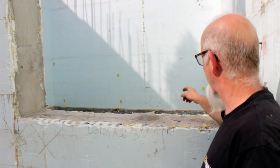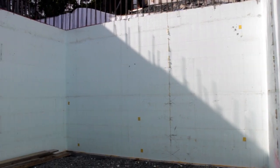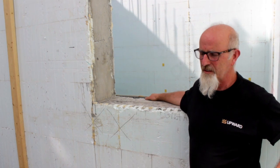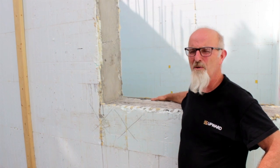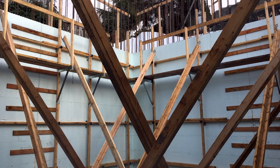We didn't have to worry about getting specialty ties for different widths and lengths — we just cut off what we needed off a 12-foot length. This is the home theater. Tomorrow we're getting all the shoring from the suspended slab. It'll be an excellent soundproof room once we're all done in here. When they poured it they required a six-inch slump. We started off with that but because it was such a hot day it began to thicken up, and the placers added a bit of water as it went with quite a bit of vibration — even though they weren't supposed to — but it all worked out fine. The system was a lot stronger than we thought.